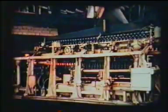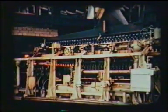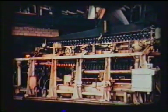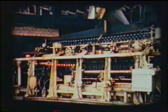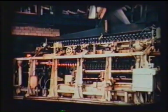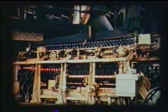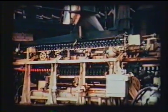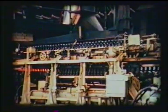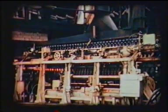In order to explain the operation of the Ribbon Machine, let us look at the 3.9 inch pitch machine which produces the large bulbs at slower speeds. From this view, one can see the stream of glass enter the machine on the left of the picture. The chain carrying the blowing tips is moving along the top half of the machine in an anti-clockwise direction, whilst the mould carrier chain is moving in a clockwise direction in the lower half. The Ribbon of Glass is carried on orifice plates in the centre of the machine, being joined by the tips and the moulds at various stages to produce the bulb.